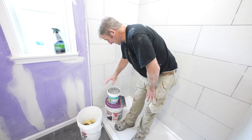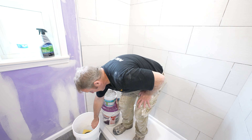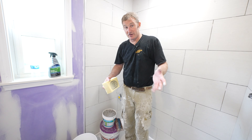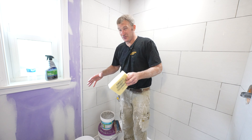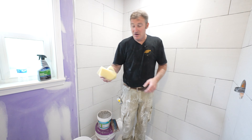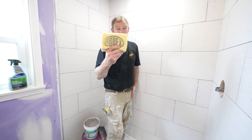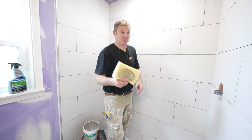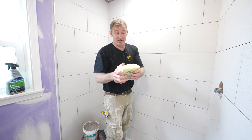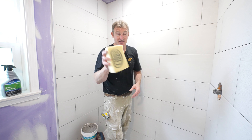You really don't have to mix anything — everything is already ready to go. I would recommend having two buckets of water so you can effectively remove the grout afterwards. If you don't have two buckets, once it gets too grimy it's hard to clean the tile. I'd also really recommend these sponges for the grouting aspect of the shower. The Ardex sponges hold more and you're able to clean them better. And they're square, so they make the joints nice and tall.